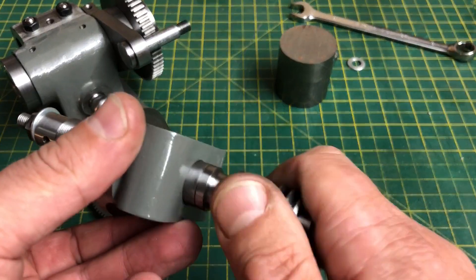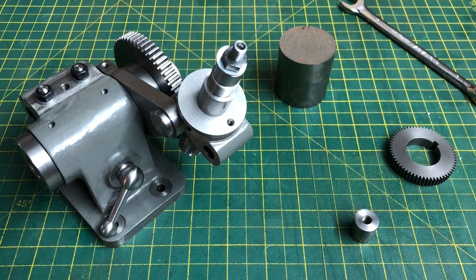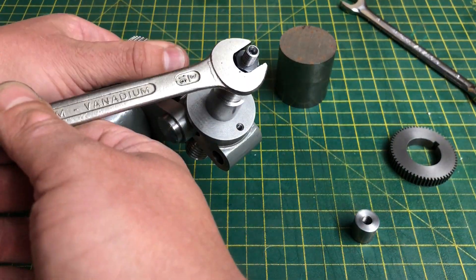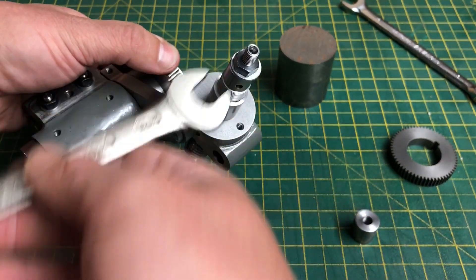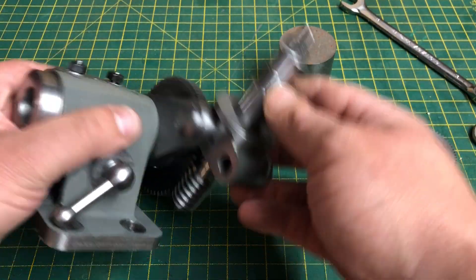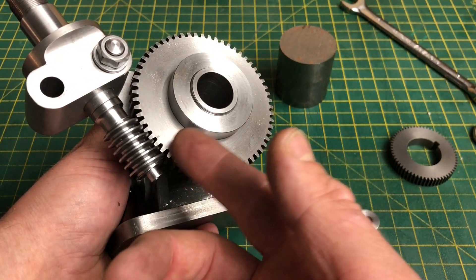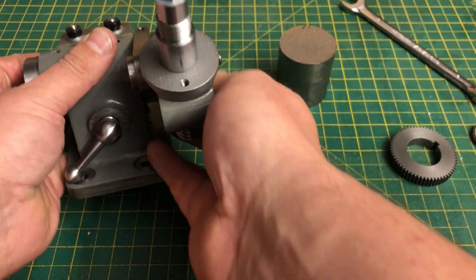In the absence of the remaining parts I'm adjusting this for now with a nut. The shaft turns nice and freely and I can't feel any axial movement at all, so let's get this mounted onto the body. Unfortunately it's not quite perfect — while the action is nice and smooth, there is a little runout somewhere. For most of the rotation there's no discernible backlash in the wheel at all, but for a small period there definitely is. Not enough to see or even feel, but I can hear it. It occurs once per rotation of the shaft so I'm pretty sure it's in the worm, not the wheel. I still have centres in both ends so I may remount and take a fine cut off the worm. For now it'll be okay and I can move on to the mount for the division plates.